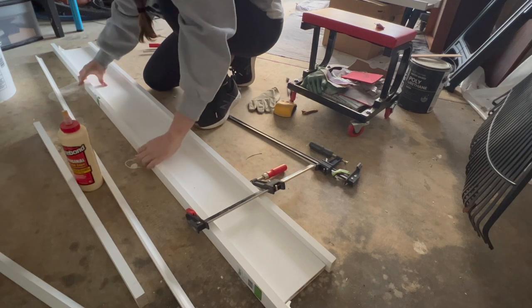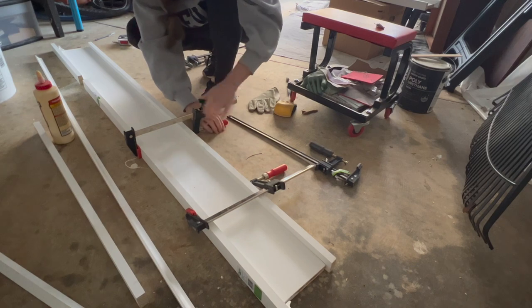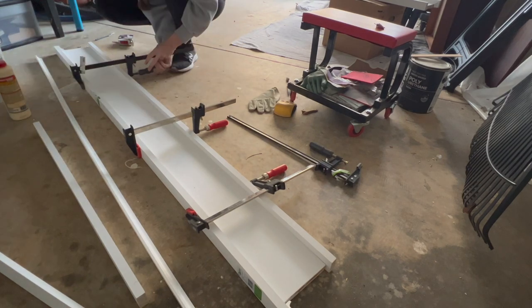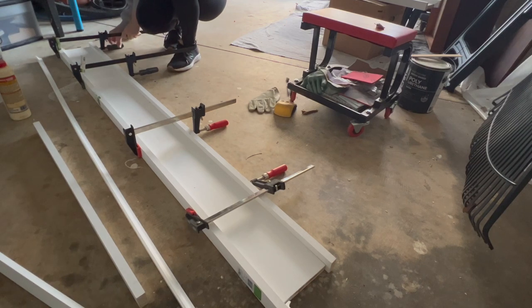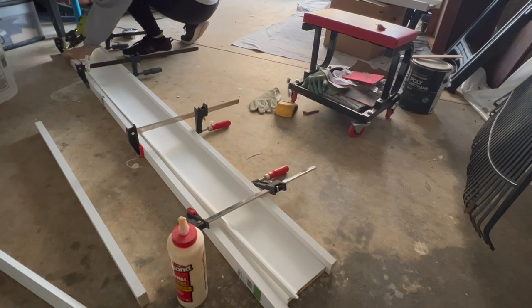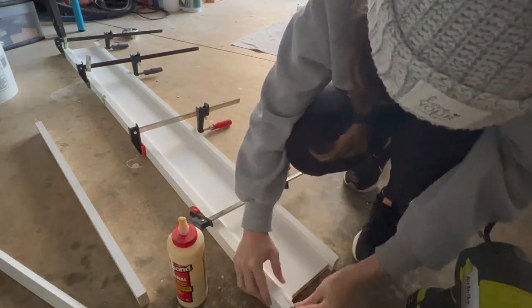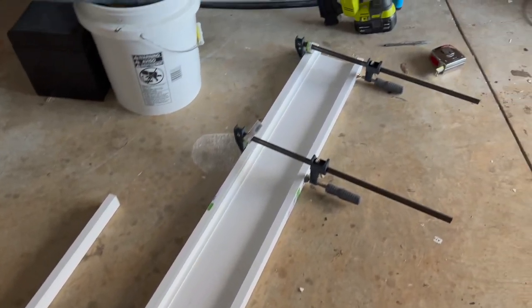This piece I'm assembling is for the laundry doors, which is why it's extra long. But if you need to piece together a few 1x2s, simply choose to do it only over the top 1x2 strip because you'll be able to mask that really easily later on with a little bit of wood filler and paint. Here's what they all looked like assembled, pre-paint and installation.